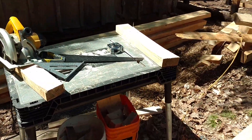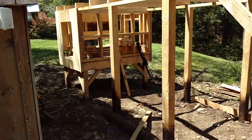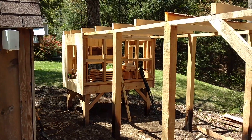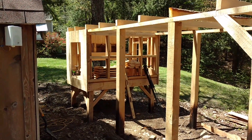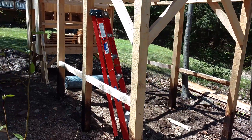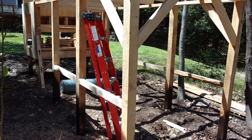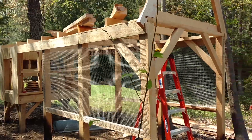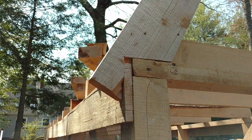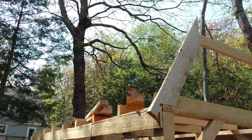I've been out here this morning making a mess. Now I have sheathing on the two short sides of the coop, so the rafter tails can sit right over the top of it. I've got my little side rails on to catch the bottom of the screen, and you can probably see the roll of screen inside. So it's going to be time to start cutting this stuff and stapling some up. I've got the top half of the screen on and the upper trim board — this is why I was saying I had to wait for the roof. So I'm starting to preload my rafters up on top.